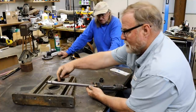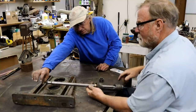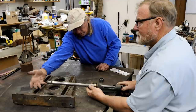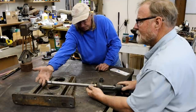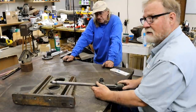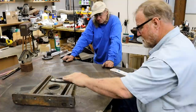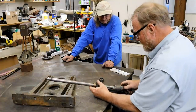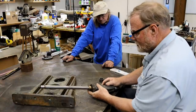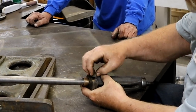And there's another carrier over here and a pinion gear. There's a bevel gear against another bevel gear. And that goes to the lead screw that raises the main table up and down. Manually. It also has a power feed, but that's the manual feed. Anyway, he's pressed this out and got it to where it's pretty close on the surface block table. But he said this all is held in place by one screw, and this is broken off.